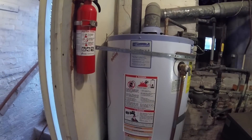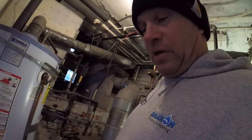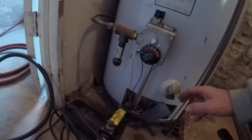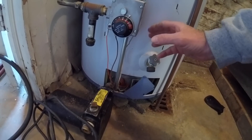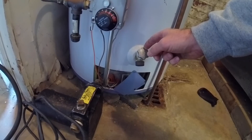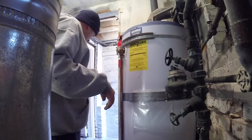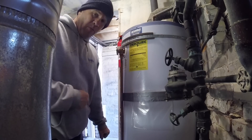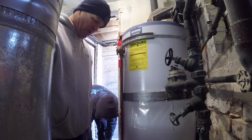This is the old heater that's coming out. Since we're in a basement area we're going to use the pump. When we hook the pump up we're going to hit the pump with charged water to clear the bottom sediment out — this is full flow when we start draining it. A lot of times they're clogged. We'll have CB hook the pump up, then open the boiler drain with the heater still charged with water pressure to clear out the sediment.